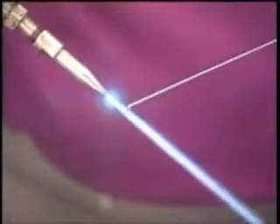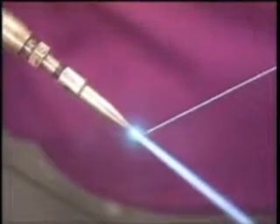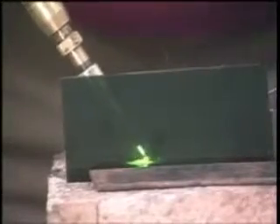Still using the neutral flame. Just keep that little cone just up off the metal. Basically, just like my stainless steel, I'm going to take that little cone, walk up the rod, wash it right back into the puddle, moving it very little. Take that rod and that cone down at the same time. On my mild steel, I lay the gun over maybe close to a 45-degree angle, a little bit more than aluminum, keeping that rod pushed right in the puddle. Because that flame is so soft and so concentrated, all your heat is confined in a very small area. And because of the low pressure coming out of that tip, you have very little blow-through. If you do blow a hole, just push that rod right into the puddle and it will fill right in. Even on longer welds, you're still going to get very little distortion.